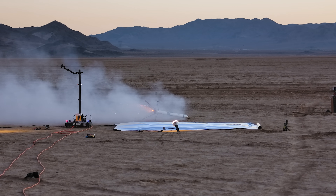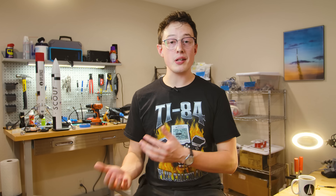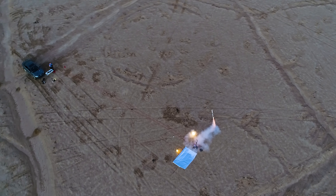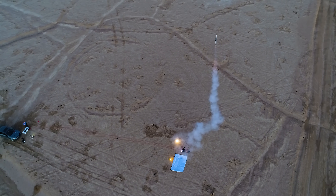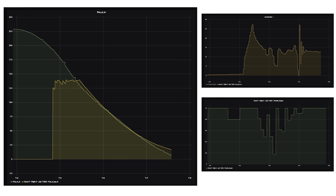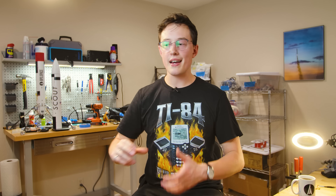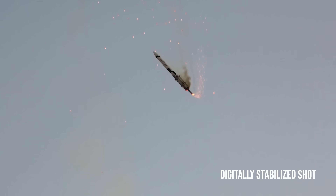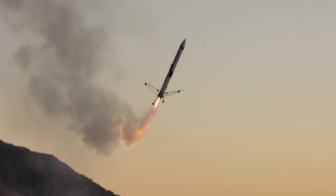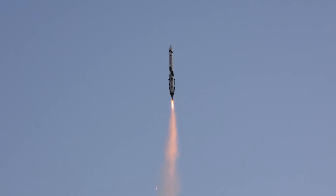While we're still not there, I promise we are getting closer and closer to landing with each flight. Let's take a look at some of the good and bad parts of the flight. First, there's no wiggle — that's still solved — and we have good control on the way up. We do have a super hard pitch over at launch, which is due to misalignment in the ascent motor and landing motor. Luckily the rocket can handle it, but it gives us a pretty sporty liftoff. Looking at the altitude data on the way down, we actually do an alright job with throttle control. Getting this throttle system to work has been a tremendous effort — it's kind of crazy how much work it takes to just tell the rocket how high I want it to be above the ground and contend with the fixed burn time of a solid motor. The throttle control isn't totally perfect yet, but you can see the rocket clamp down and reduce thrust as we aim for altitude set points on the way down. The other thing to mention is the period between the two burns — this area of flight is a little rough. I have some code in there to zero out the angular rates before the motor burns out, but clearly it is not working that well, since once we burn out we start pitching over to the side.